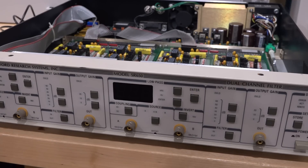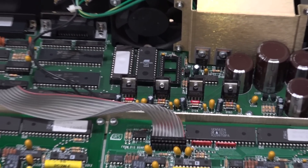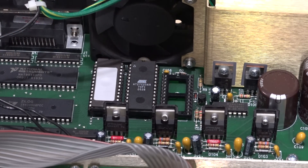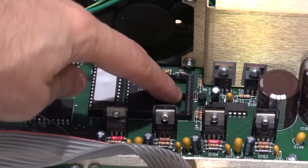Unfortunately that hasn't fixed the problem — it's actually made it different. Now when I turn it on we've lost our Christmas tree, so everything is completely dark. There must be another problem. It's consistent with somebody having worked on this before — which explains why that chip was already socketed. And there's a missing part: this component is not populated. It should be there because there were three parts on the digital bus of the processor and this one is missing.